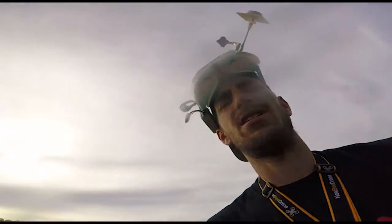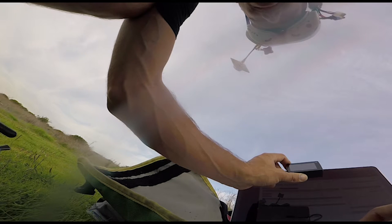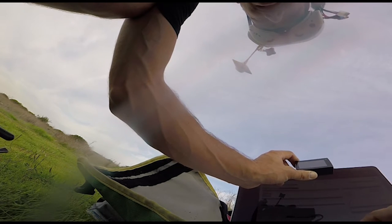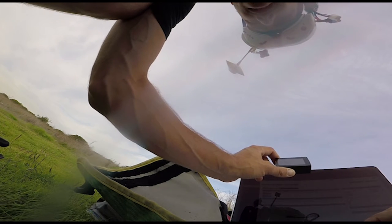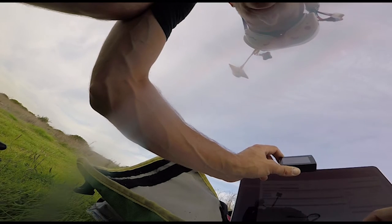P's feeling pretty locked in. We're gonna bump D up a little bit. So we'll try 31. And drop these rates a little bit. Save that. And then we're gonna bump the I up just a little bit. All right, it's battery number 4.